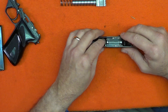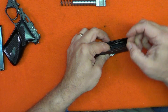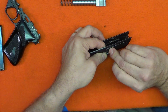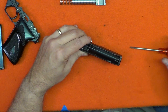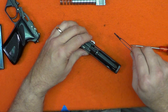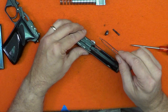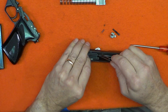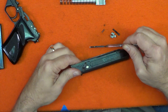The disassembly of the slide begins with a 3/64th inch brass pin or punch. Pull the extractor away from the slide and use the brass pin to retain it in place. Next, locate the screw that retains the breech faceplate and remove the screw from the faceplate. Be careful to keep the slide level so you don't lose any parts. Once the screw has been removed, then remove the faceplate and the firing pin spring. Take careful notice of the orientation of the flat spot on the end of the firing pin. To remove the firing pin, you must place the safety in an intermediate position and then remove the firing pin.